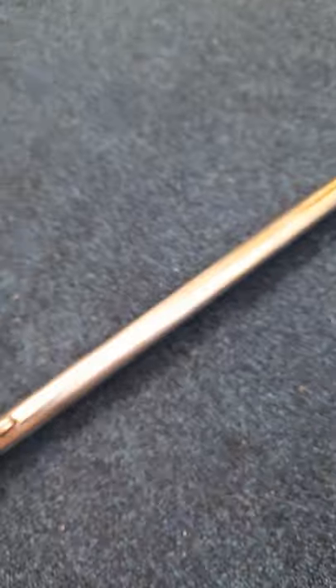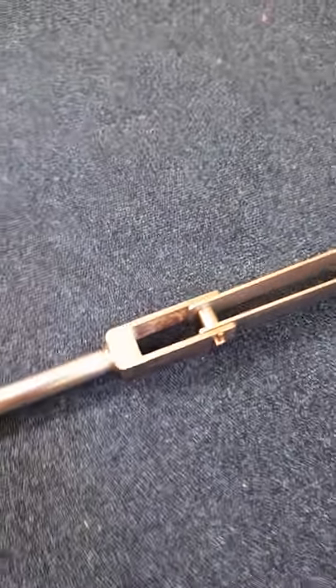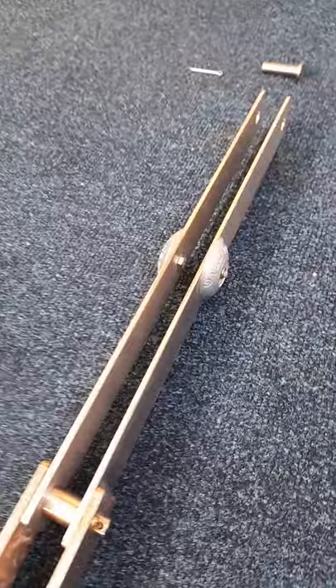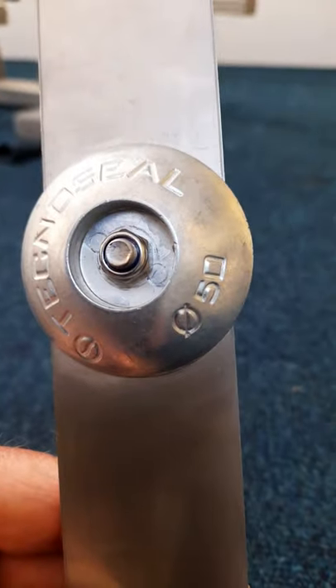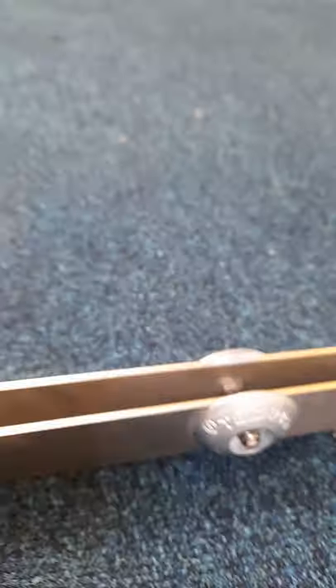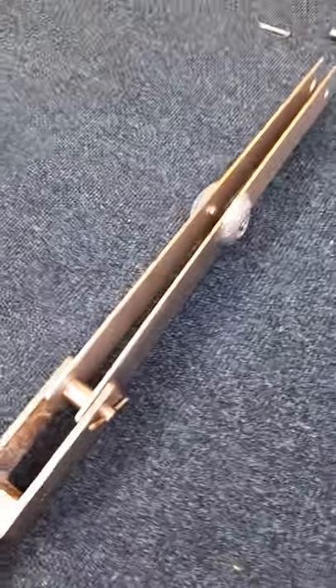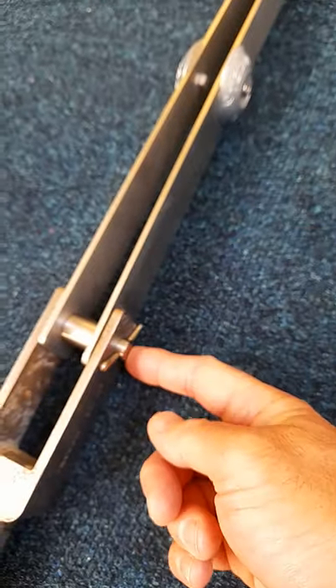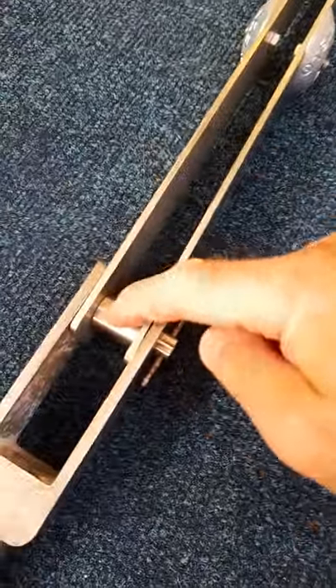This is my old one but it's all stainless steel and cleans up very well. There's the fork. I've bought a new pair of these stainless steel straps — they only came with one anode, and I've put two of my own anodes on, measuring them very carefully, one on each strap. I didn't think it was a good idea to have just one anode on one strap. This comes in a pack with a new stainless steel pin, a new stainless steel split pin that goes through the pin itself, and a spacer.